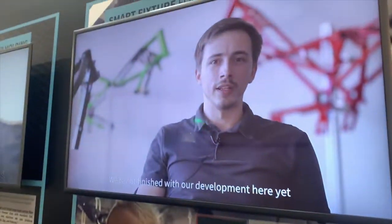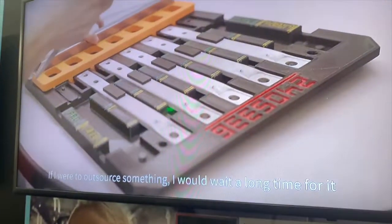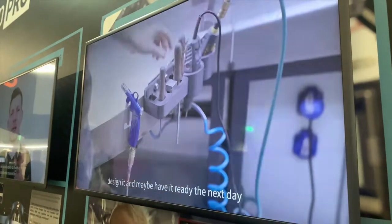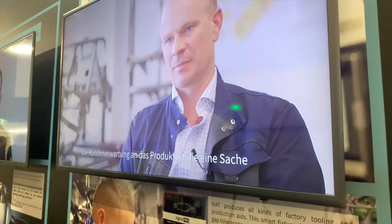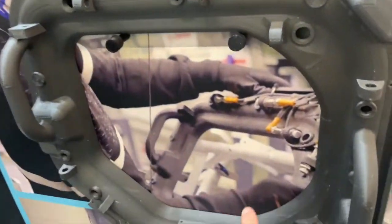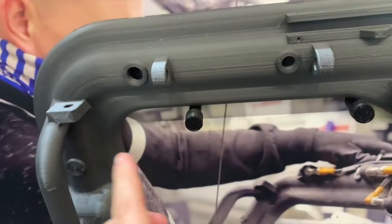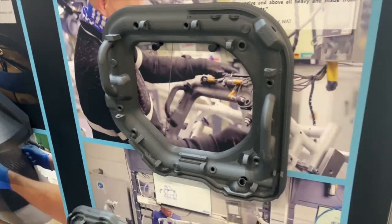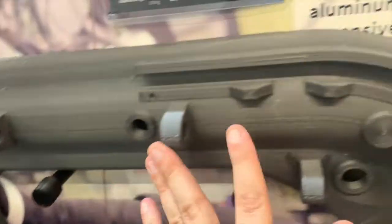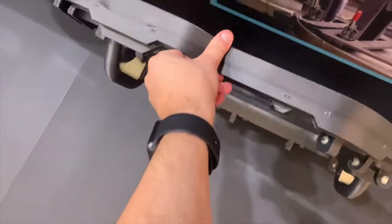We're showing a WAT customer using our printer on the shop floor for production. André is an amazing guy using our printer to solve multiple issues in production and improve every aspect of the process — truly an agile manufacturing tool. He just goes around the shop floor, identifies problems, and solves them with the 3D printer. This beautiful smart fixture is used for quality control: it's fitted with probes all around so when you insert a part, the probes check that the holes are the right dimensions — a go/no-go system. It would be insanely hard and expensive to make this with CNC. This one is high-temp CF printed without support; you can also see a version using PVA as water-soluble support — before and after.